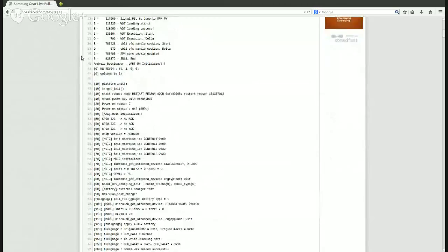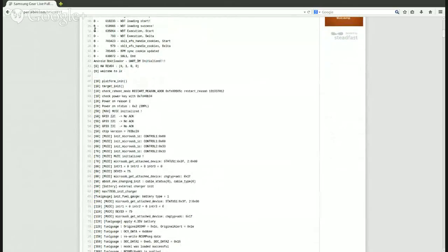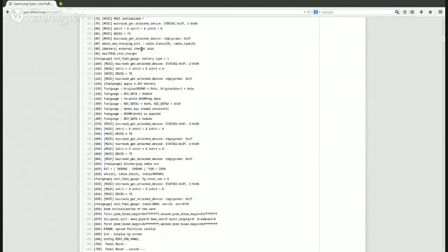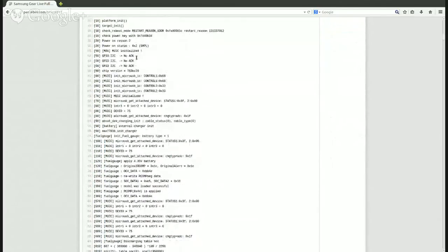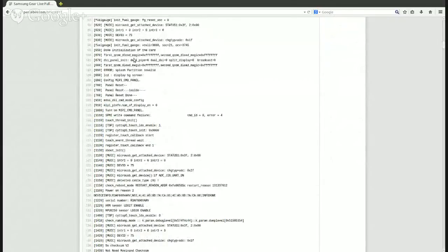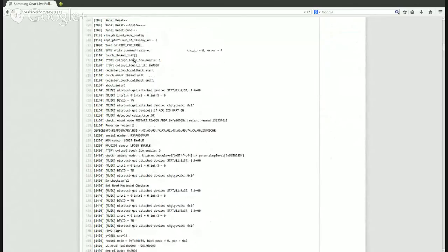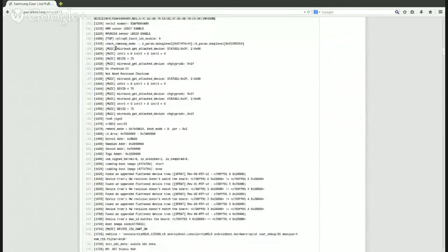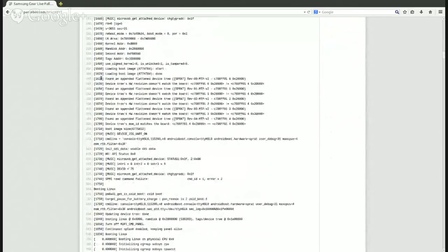So how does that affect how it boots, though? Well, normally a bootloader would extract the kernel and pass to the kernel where the RAM disk was and so on. As an extra step, the bootloader would extract the device tree portion and pass that to the kernel, kind of like it would with the RAM disk, so that the kernel can read from the DTB.